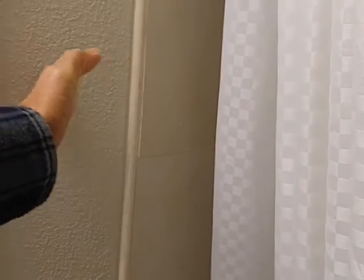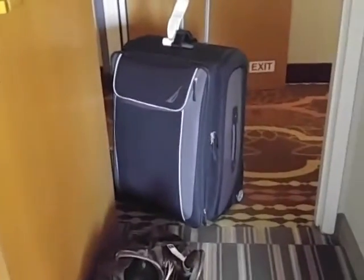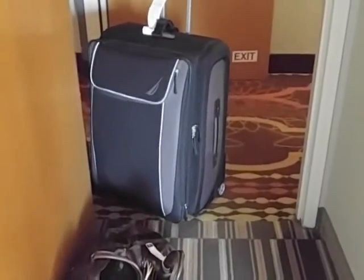They did continue the tile past the tub just a wee bit to stop damage to the sheetrock. I always use cement board — Durock — go past the tub, then use ceramic tile over the rest of the bathroom including the ceiling, which I drop down a bit. No need for an eight-foot ceiling in the bathroom. Anyway, I broke down and bought a tuner.